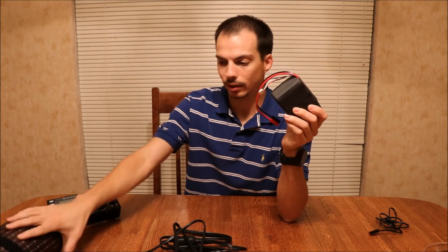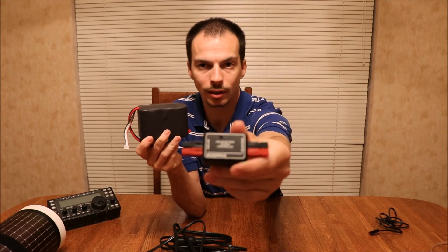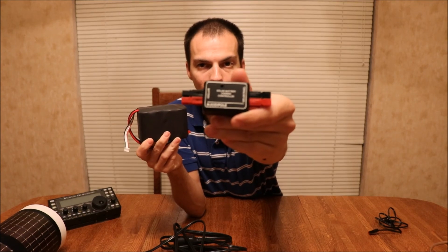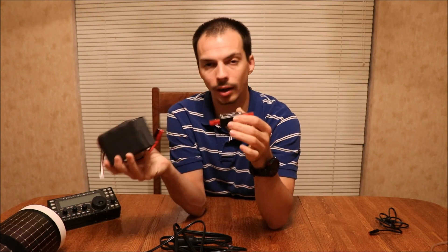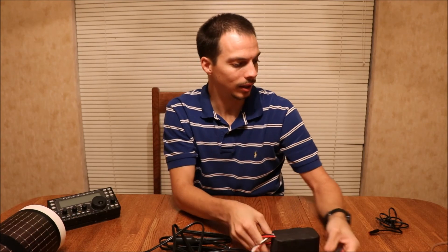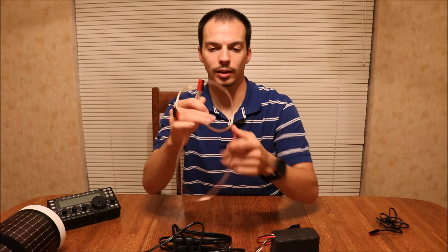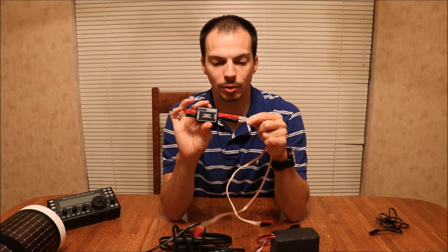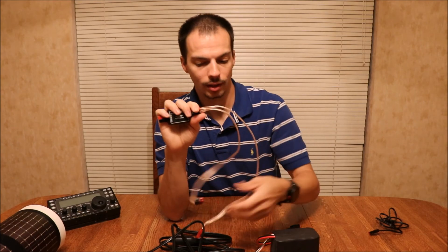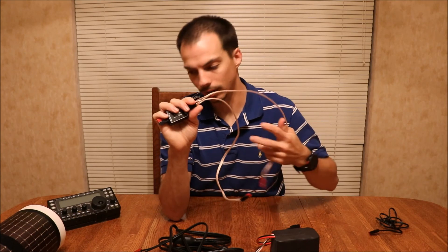So I've got the solar, I've got the battery. I also bought the solar battery charger from BuddyPole. This little guy goes in line, but what if I want to operate the radio at the same time? I made this little Y adapter — you plug in your solar panel on one side, this cable on the battery side, and then one end goes to the radio and the other end goes to the battery. That'll run the radio while also charging.